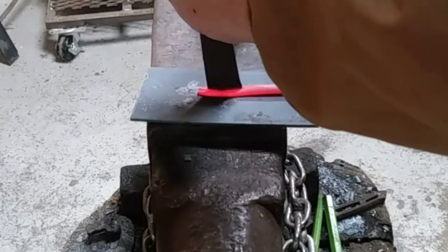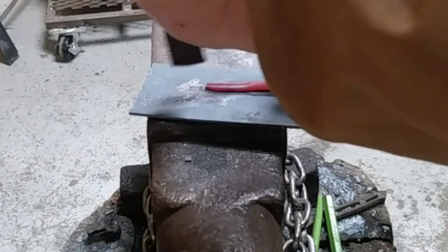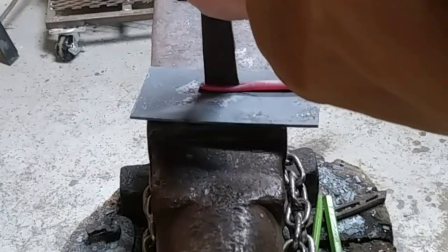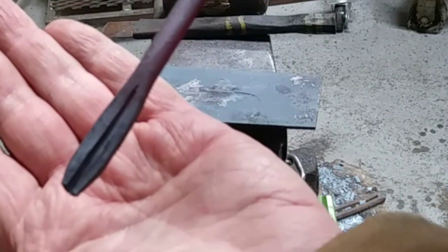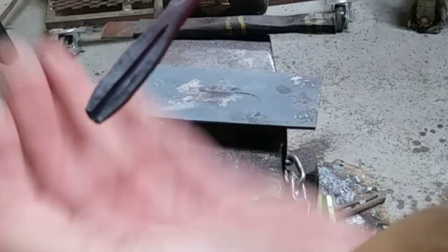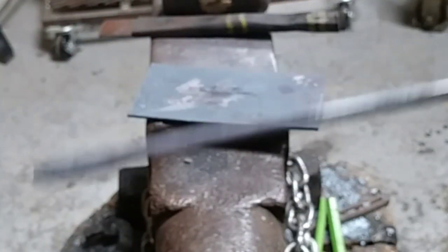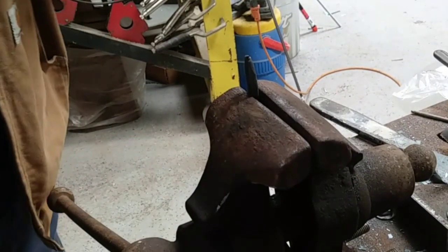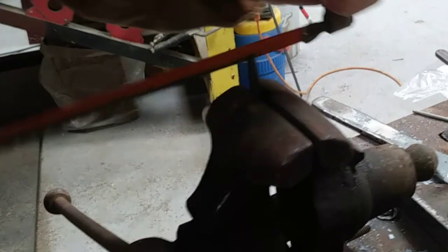I think I lose too much material if I just saw it — hacksaw or bandsaw — and I don't like a lot of rag. So by going most of the way through — not all the way through, but most of the way — I've pushed the metal away, so I've only got that real thin little part. This is where I change things up. You can either hack saw through it because it's not very thick at this point.